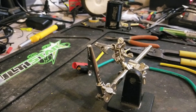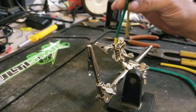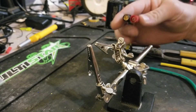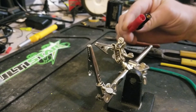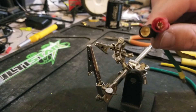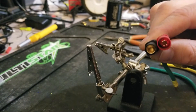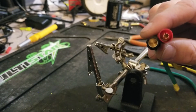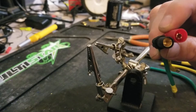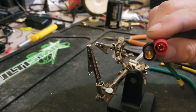Hi, I'm going to work on some XT150 connectors. We're going to make a charge lead. I'm going based off of the charge leads that they sell on Hobby King, which would have the larger connector inside the smaller black connector side and the male bullet style inside the larger red side.